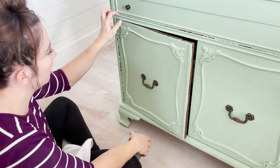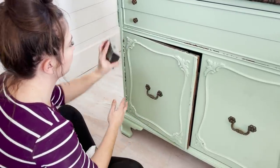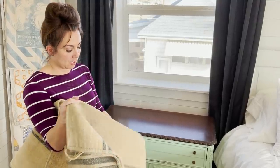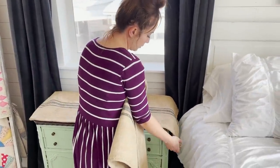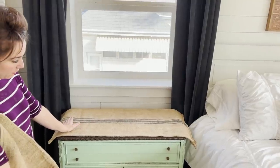You should seal your product when you're finished with it — I'm not going to because I've run out of time. Someday I might come back and white wax it. I can wipe this down no problem and it's not going to get a lot of wear on the top. Most of the wear on nightstands and dressers is on the top, which we've already finished. I've covered it with a grain sack because it takes a little while to cure and I don't want to mess around with that.